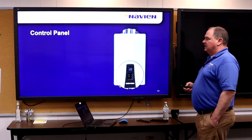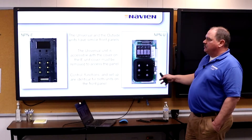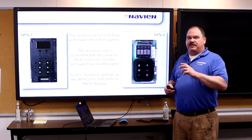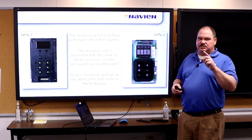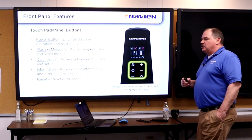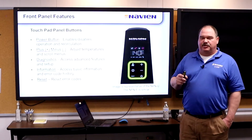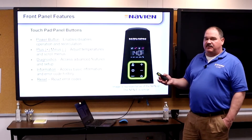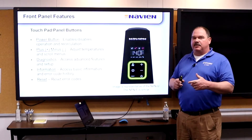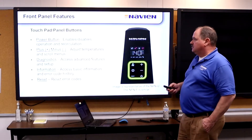The control panel gives you a lot of good features. The indoor unit has buttons accessible right through the cover. The outdoor unit requires you to take the cover off, which is why we provide the wired remote. On the unit you have a power button — you can turn the heater off without disabling the built-in freeze protection system. So for a vacation property or hunting lodge that's unoccupied in winter, just turn the power button off — don't just unplug the heater.